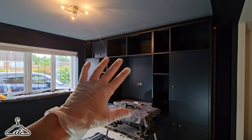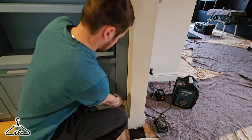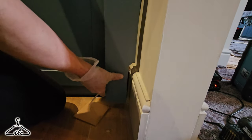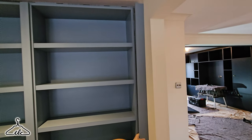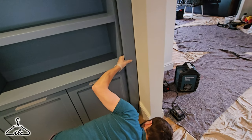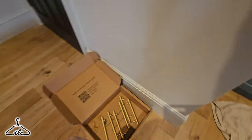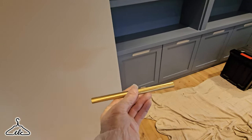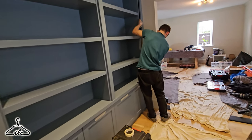Left to do is just get that one flap on with the two hydraulics, then that's all the doors done — one trim, two trims, side panel. Sean's brought one trim in and is trying it in. Let's pull that tape away — look at that scribe! He's tweaking it a little but he's getting there. It's a tight fit because we've got a ledge here which we don't want to damage. He'll have that in in no time. These are the handles I'm using over here — we've got six. I really do like these plank handles; they're probably the best place to get handles. I need to work out where these holes are going to go and then pre-drill those.